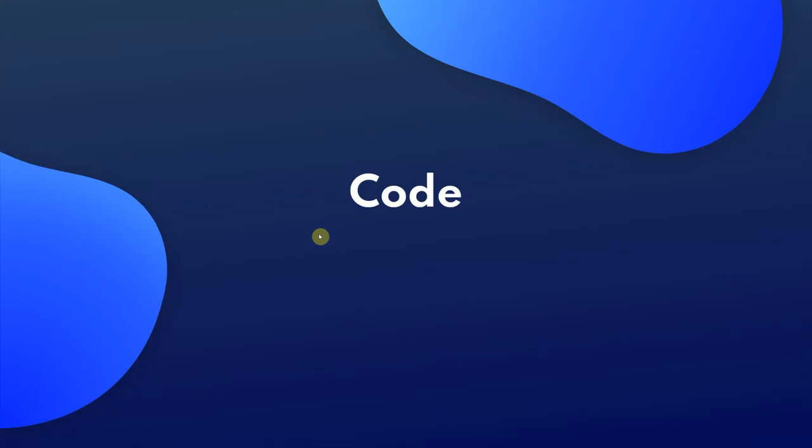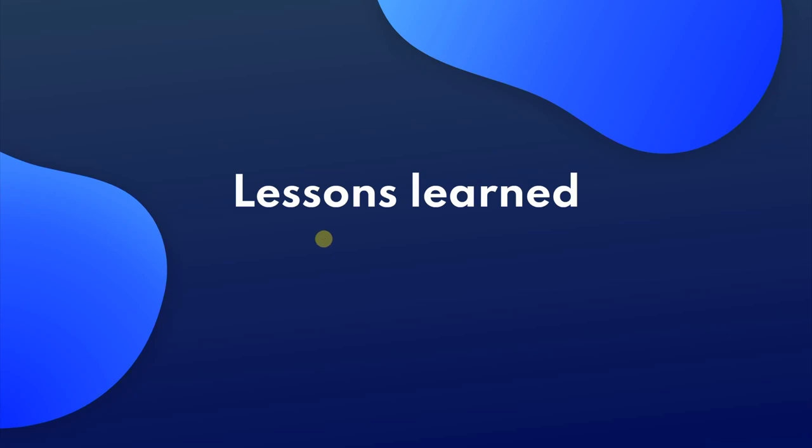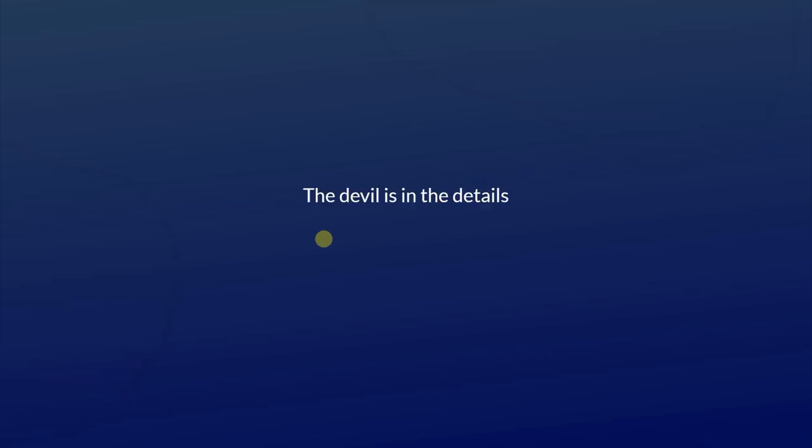Finally, I will run through some lessons that I have learned while making this project. Firstly, the devil is in the details, meaning that if you want something to run for years on batteries, everything has to be deliberate, and small mistakes can ruin the whole project. Source control everything. I usually make a private repository where I work on my project, and when I want to share it, I make a new repository. For instance, at GitHub, I make sure not to share my private keys and such. I also usually keep 3D models and configuration files and documentation, data sheets, and stuff that you usually don't associate with source control. And this is useful even if you are a single developer. It can be a lifesaver to be able to go back some versions.